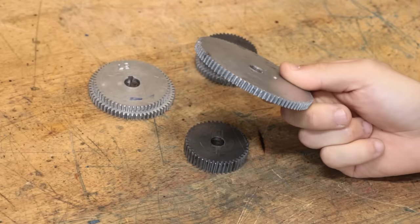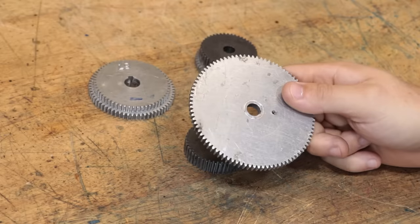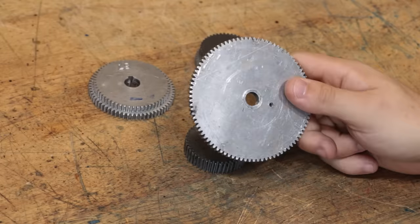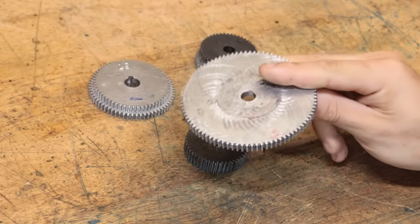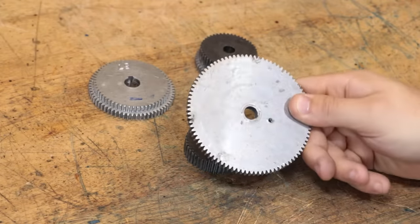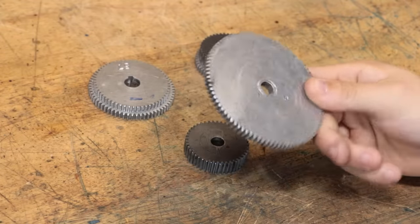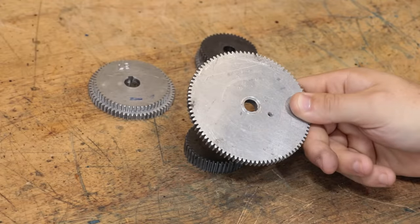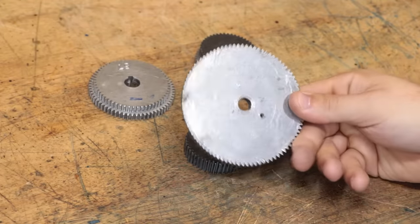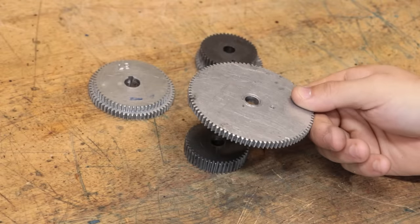The gears that I use are a module 1 with a 20 degree pressure angle. Now without getting too caught up in gear theory, essentially what that means is we need a cutter with a 20 degree angle on each side, which effectively adds up to 40 degrees in total, with a small flat on the end. It's effectively the same profile that we'd cut if we were going to cut a gear rack. If you want to find out exactly why, I'll leave a link explaining profile angle, but that's essentially what it boils down to.